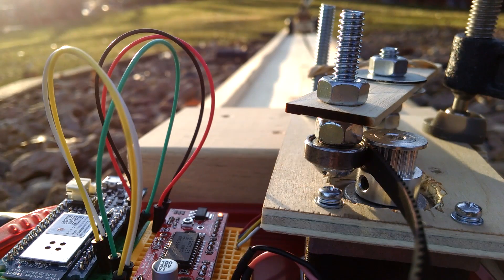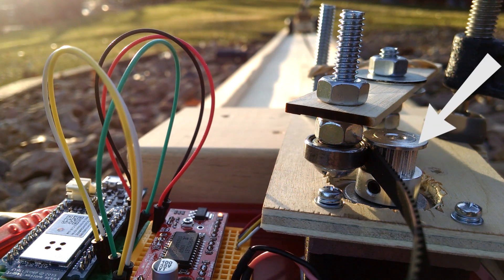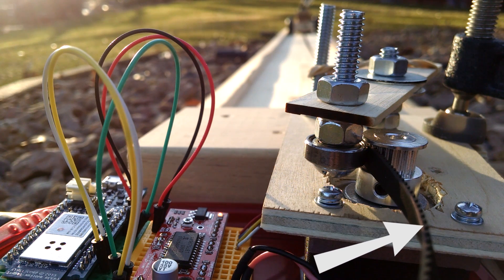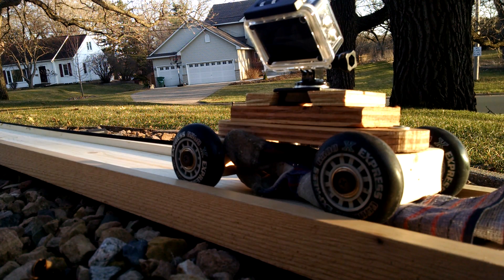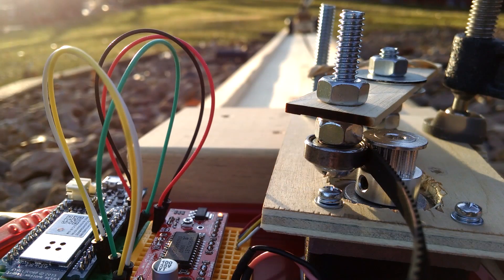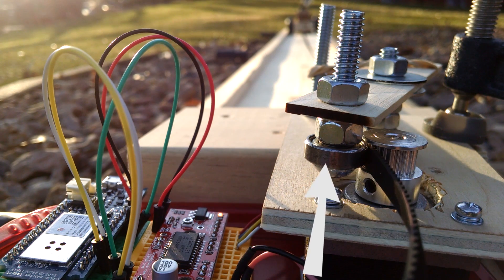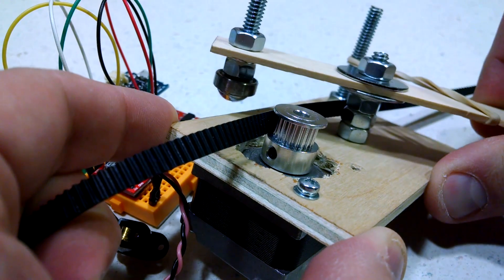The hardware is relatively simple. To move the camera dolly in a controlled, precise manner, a stepper motor turns a small timing belt pulley to pull on a long length of timing belt, which is attached to the camera dolly. With this configuration, you can adjust the length of your belt and track however you want, and you can connect it to almost any kind of camera slider system. To keep the belt engaged with the teeth of the pulley, a smooth bearing keeps the belt pressed up against the side of the pulley. This can be easily released to feed the belt through by hand.